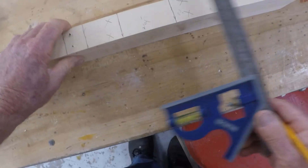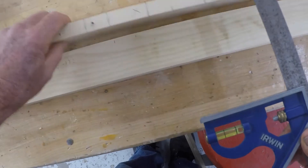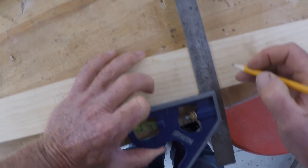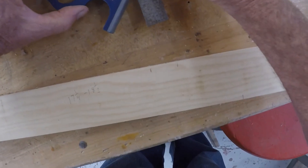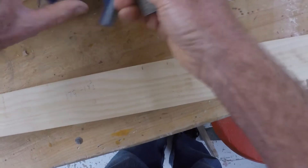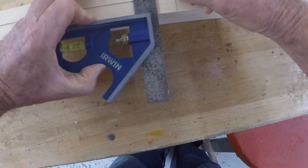The ten and a half line in the middle has to be carried through to the other sides. I'll make a little tick mark on the side, roll the pieces over, and carry that ten-and-a-half line to the back of the board. Everything is referenced from the point end, because that's the reference point for the whole chair. I make a square line across the back and put the X to the left of those lines — those are for the two-inch boards going in.